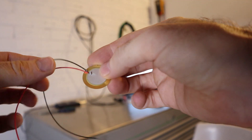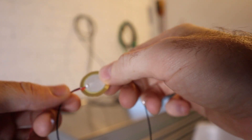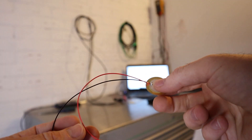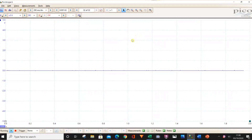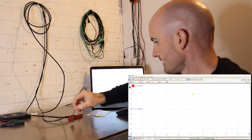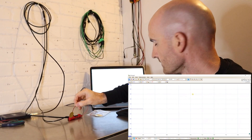Just a close-up of this sensor: on the top it's a little metal disc with the piezo element itself on top. The black wire goes to the disc and the red wire goes to the piezo element. Let's connect it to the scope and have a look. We're set to 5 volt divisions and 200 milliseconds on the time base. As we can see, if we tap the sensor on the toolbox we get these little spikes.